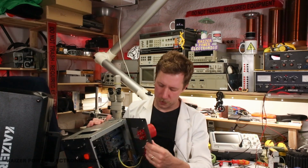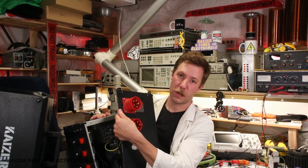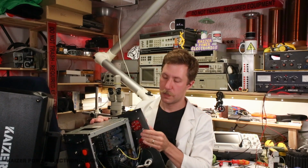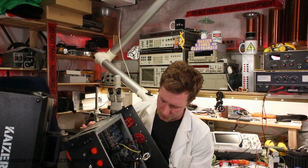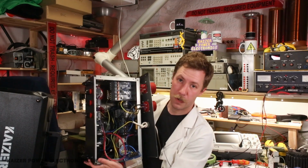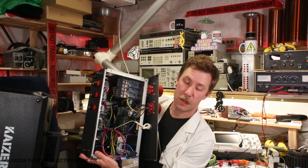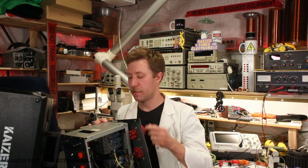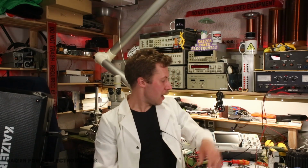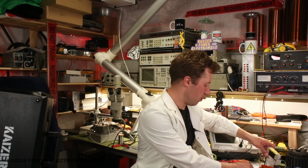As you can see, that utilizes some different plugs for 16 and 32 amps, and on the inside it is just a bunch of relays and timers and some power resistors. Now I want to upgrade this to also have some safety features like the emergency stop that I built into the show controller in part 7. And that's the circuit we have sitting over here.